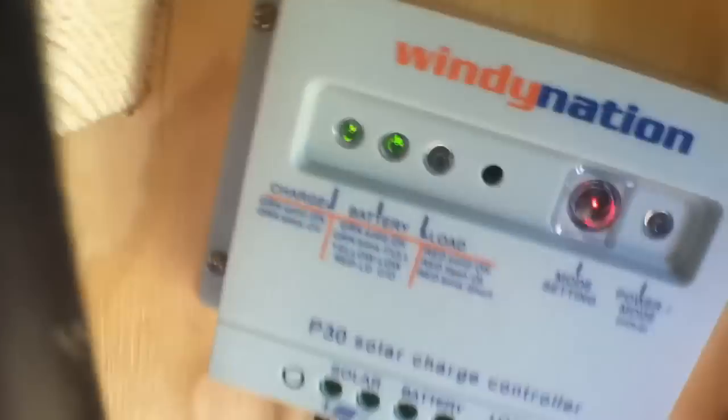And now this is a 250-watt element, and the water heater, he'll have all the water lines ran to it and everything, but this will always be heating for you. So when the sun's out, you've got a 300-watt setup, so it's always dumping load. Like right now, the battery is charged up again, and so all that would be dumping to the water heater, keeping you hot water. And then if you ever have a situation where it's at nighttime and you need to turn the water on and heat it, then you can just flip the switch and you're feeding the power. But I'll show you the wiring setup here once it's completely finished.